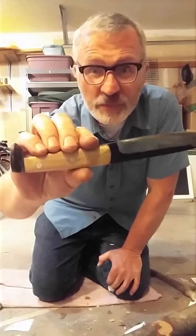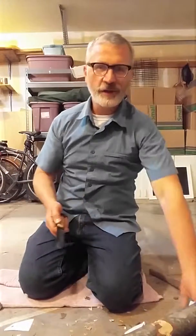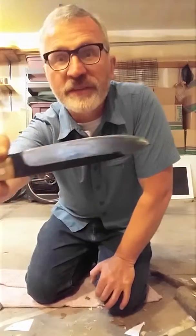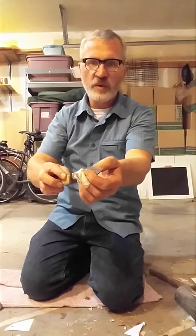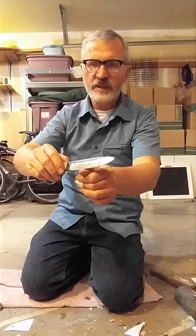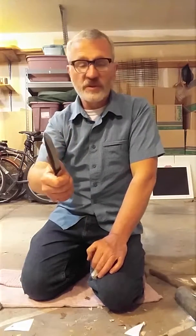One thing I can say for sure — even though it's a fairly small handle, that little knurl on the end, the little pommel, works pretty nice for gripping when you're doing that. So after whacking the log about 20 or 30 times or so, I can't see any defect in the edge of that blade. There's no nicks, chips, folds, rolls, or cracks. When I run my fingernail along it, it doesn't catch on anything — no tiny chips or rolls. And when I do the fingernail test the other way, it still catches, all the way out to the tip. So it still passes that sharpness test.